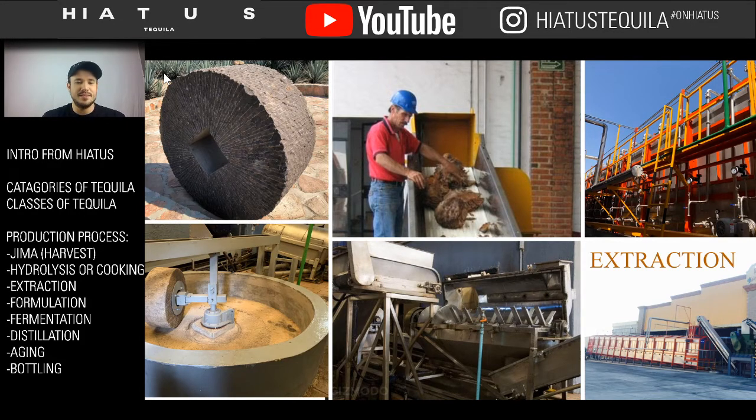So the diffuser, at least the one that the Mexican government recognizes, uses both a vertical autoclave and an extractor. So they kind of do it backwards. They first extract, and then they cook the juice. They use this methodology where they shred it, they wash all the juice out, then they put it through these big steam jets, steaming it out. And so you get all the sugar, but you also have shredded it so much, you get all these fine particles of other things inside the juice as well.